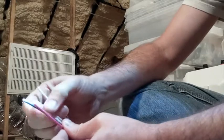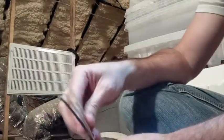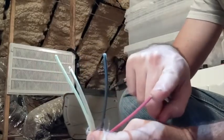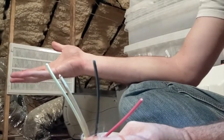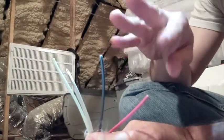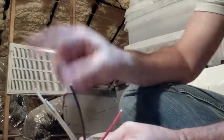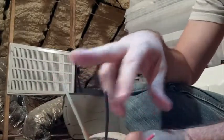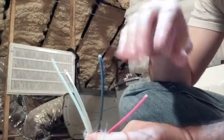There are several tools built for stripping wire. I like to use a blade and some wire strippers. You want to expose about four inches of the insulated wire — take your blade and cut down it like so, then peel it back. I like to cut that outer sheathing away to get it out of the way. Now, this is what they call 12-3 wire — there are three insulated strands. This is also known as the evil red wire, because when it pops up in the middle of your electrical work, nobody knows what to do with it.